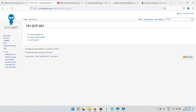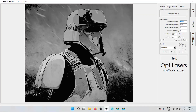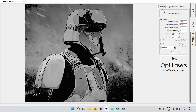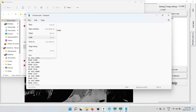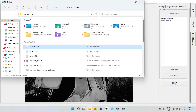The software that comes with it is a laser engrave software, but this one was all in Chinese — the icons and everything — so I didn't even bother with it. I ended up using Creality Workshop and their G-code generator. In Creality Workshop I did a Star Wars logo, but I didn't like it because it didn't seem to have a lot of settings options. So I moved on and used the G-code generator for different images. I'm starting to get the hang of it. The only issue was that when I tried to rewrite the header in the G-code settings, it kept crashing. So I just went into the downloads and erased the header altogether, then resaved it. As long as your X and Y were at zero and your Z was at a hundred, it would just start automatically — and that worked for me.